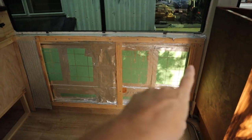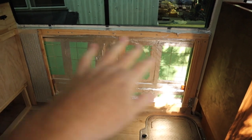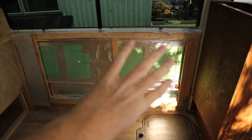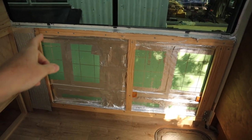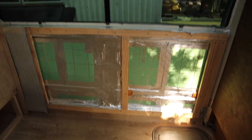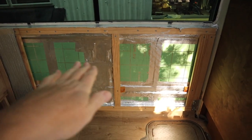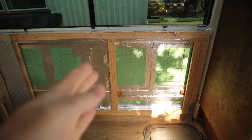I've taken off the thin ply sheet lining the wall here because I've changed my mind a bit about how I'm going to build out this area. I wanted to see what studs and battens I had behind. I'm going to be attaching some more pieces of timber to the studs and battens already in there, mainly because of what I'm putting under the table — it needs a fair bit of support. I'll put in a few studs to mount the support brackets, and another rail up top to support the table.